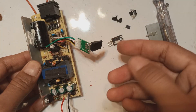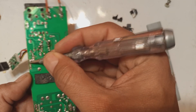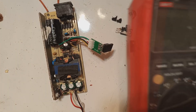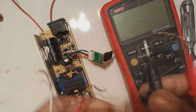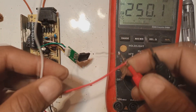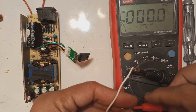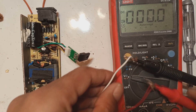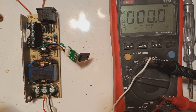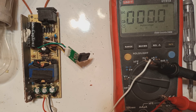Now we will confirm our work. If we made any mistake, we can correct it before powering this up. We should also clean the MOSFET legs so there is no solder residue. Now is the time to test. With the meter on DC voltage range, we connect the red probe to the positive output and the black probe to the white wire (negative) of the power supply. We are also using a series lamp first before connecting it directly.